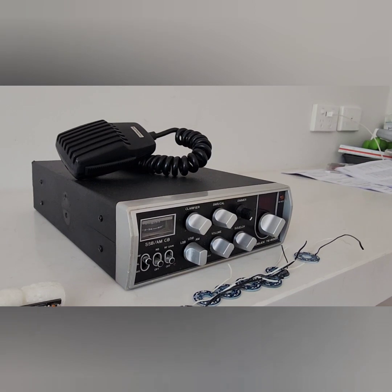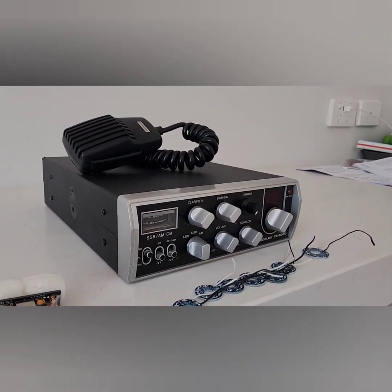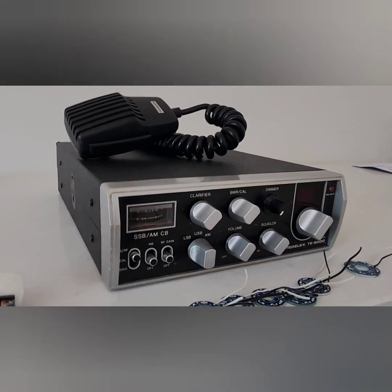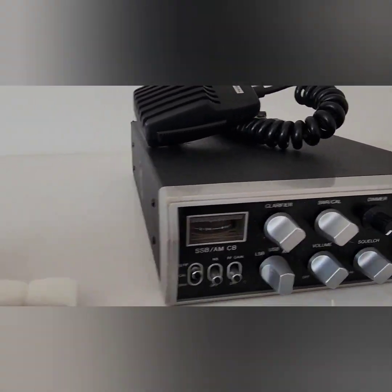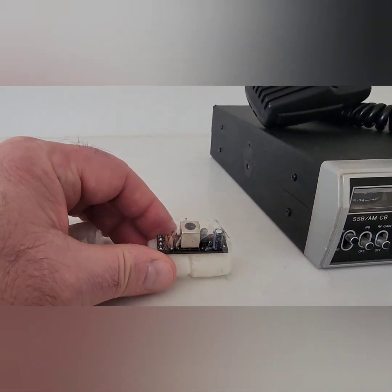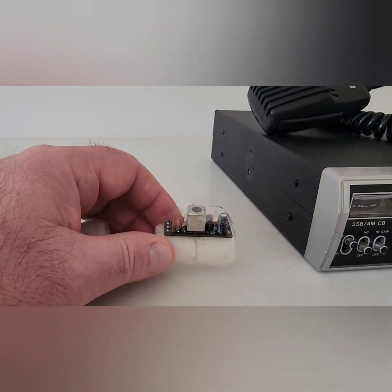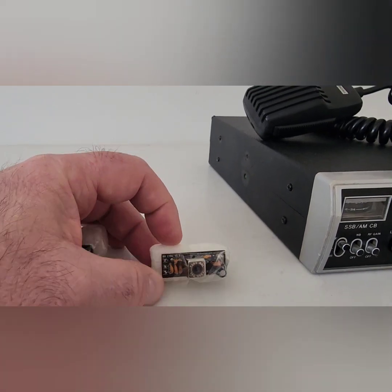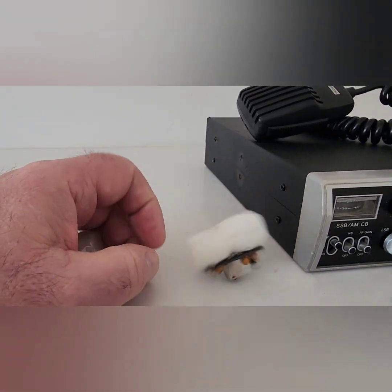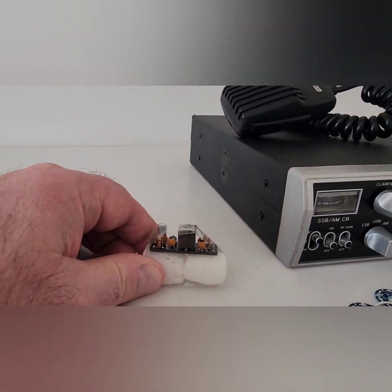All right, so then what are we going to do electronically? There's a couple of things that this radio has issues with. The first one is the VCO needs replacing. So my choice of VCO is the Razer Radio's VCO. And why do I do that? This VCO has all supporting intel on its performance on Ray Costantian's website of Razer Radios.